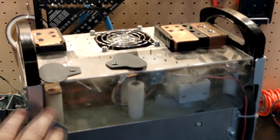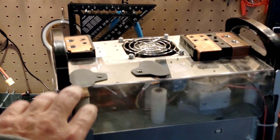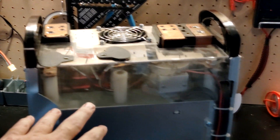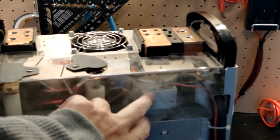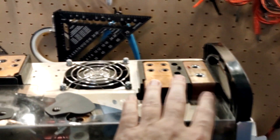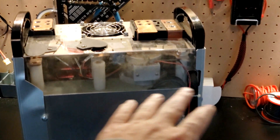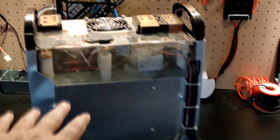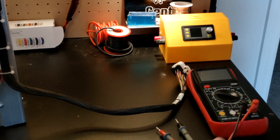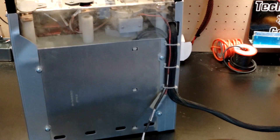So let's take a look at the casing. We've got this little plastic cover here. For some reason they didn't include the fuse that would go here — not a big deal since we're going to tear this down, but if you wanted to use this as-is you would definitely want that fuse. This case also has the contactor right here. We've got a couple of bars up here and we'll go over those as we tear it down. There's a fan. On my first observations there are no circuits in here, no BMS — but there are lead wires that come out to that cable. Everything is done externally, which is kind of good. We don't have to worry about certain things and we can actually leverage that wire if you want.